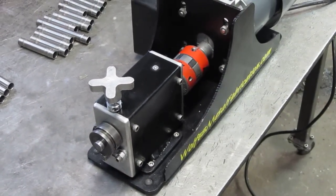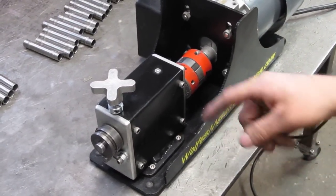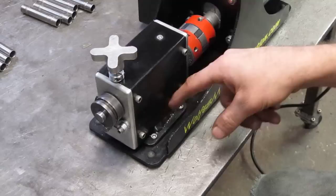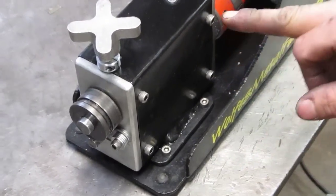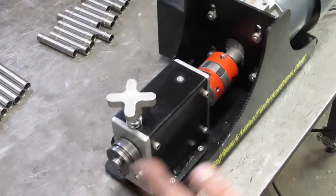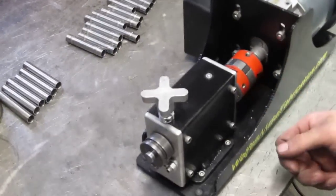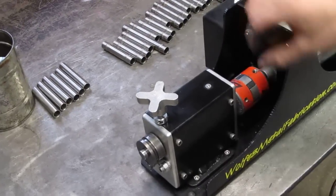If you need to take it apart to change shafts, for cleaning, maintenance, whatever — the best way is take it off the base with the two bolts on this side and then the two on the other side. Then remove the two bolts in the rear on both sides. You don't have to disconnect the Lovejoy coupler or anything else. Just tap on the shaft up here slightly to get it broken loose. Then you can pull the rear plate off and the lower shaft will come with it.